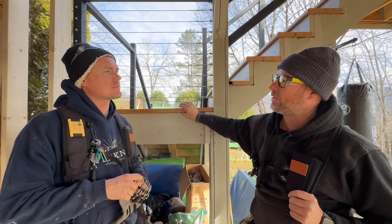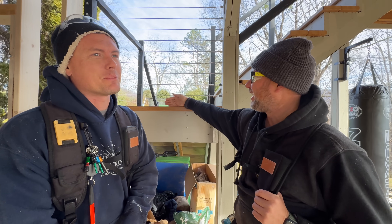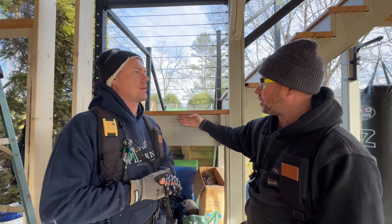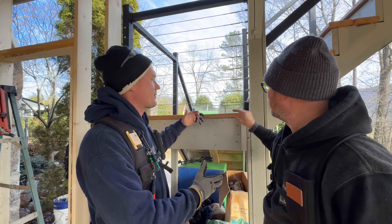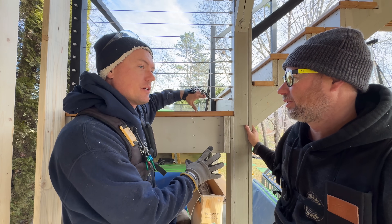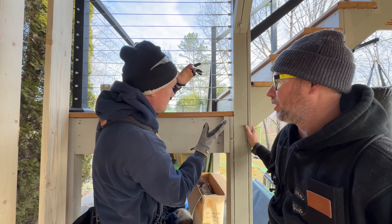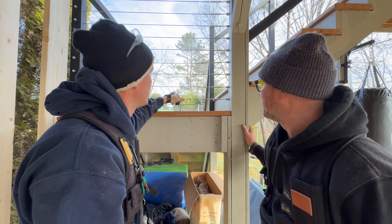We're framing this wall across where this landing is and this decking sticks off an inch from the landing. I'm just now realizing we're going to have to cut this off to let the sheathing run through, because where the posts are is in line with that. We're just butting the sheathing into that, but I don't think we want to butt sheathing against sheathing and have a hole in the sheathing where the decking is. No double butt for sure. I think we're going to have to use a big piece of flashing to get from up here — you're not going to be able to put siding behind it in any way. Not only can you not fasten it, there's no room for it. So zero-thickness material — a big old piece of flashing. It goes up and under some siding here, and then it kicks out over top of the siding here. Just like we do on a deck band that you add to a house after, except the deck band's already there. It's all reversed. The roles have reversed.